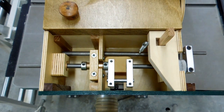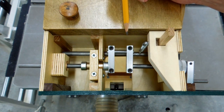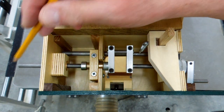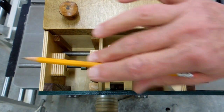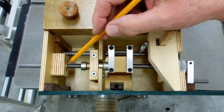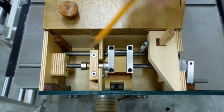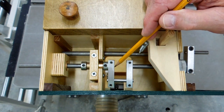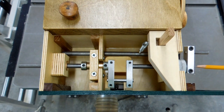I'm using a segmented crankshaft, and this has an awful lot of advantages. If you weld a crankshaft you can have so much distortion — a friend of mine, Jay Cochran, made these, and that makes life a little easier. You determine how long this piece of rod needs to be. This is 5/16ths, as is this. This part of the crankshaft is quarter inch and this is a one-inch throw. We do not want this to be able to go back and forth, so there are two 5/16ths locking collars. We're running in a top-hat bushing here and on this end, and this is just a straight bushing. The locking collars limit the travel back and forth. You want the 5/16ths to be flush here and here so they don't interfere with the top end of the connecting rod.